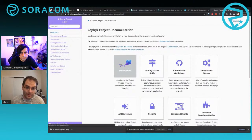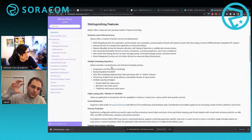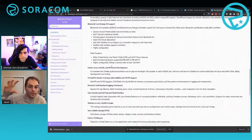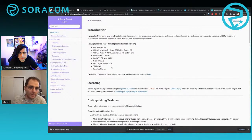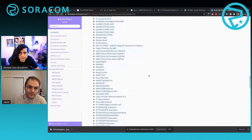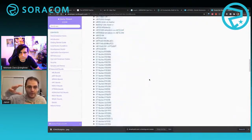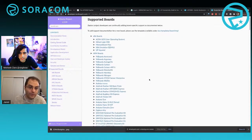It's kind of like Linux for embedded devices, and they do some interesting things with creating your device and how you interface with it. They create what are called device tree files, which are your device definition, and then you plug that into whatever code you're running. It's a different concept from Nordic's previous SDK, where you create a header file, enter the things you want, and maybe it works. And they have crazy long SDK config files. But if you've ever used FreeRTOS, it's very similar to how they configure it. You can do it through a command line menu, or edit it manually in the project files. And as you're scrolling through, there are tons of different boards and hardware.